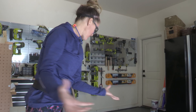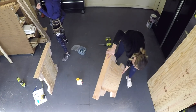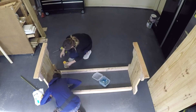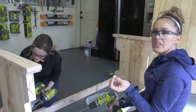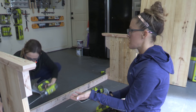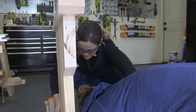Now it's time to add the bases to the feet. We're going to mark center on each of these bases — that will be one and a half inches — and then set it on top of the base. Now we're attaching both leg bases using our aprons, which are 2x4s that run flush with the top of those leg bases and flush with the sides, attaching those with two and a half inch pocket hole screws and wood glue. This is a modified plan — the original I designed to look like a pew bench, kind of a coffee table bench. Then one day I thought that would make a really cool farmhouse table — a style I've never seen before. It looks like something you would find in an old vintage shop, like an old treasure, but it definitely would cost more than $60.